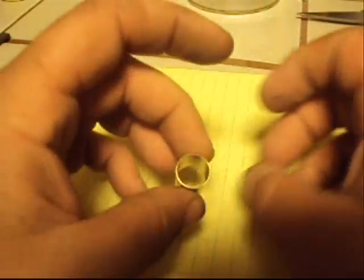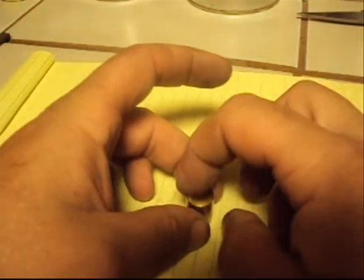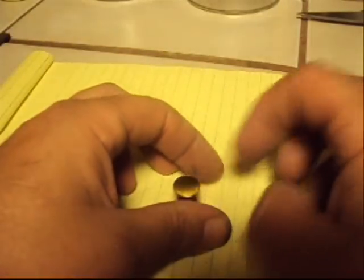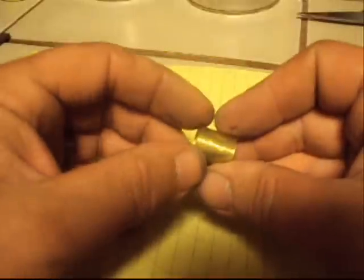Now I clean this up with alcohol. We're going to take a piece of rod, stick it inside with a little bend on the end and a loop at the top — that'll set it up for the linkage. Then we'll fill it up with epoxy, or some Permatex, or even fiberglass if you want. Anything you put in there that hardens and fills up works — you just can't have it on the outside.